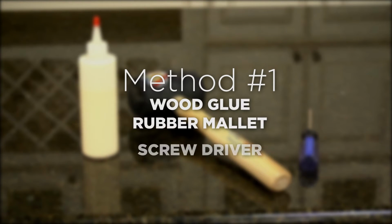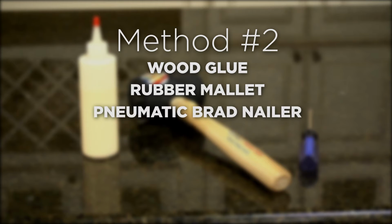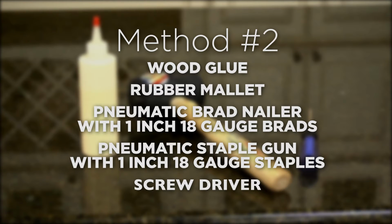First construction method requires wood glue, rubber mallet, and a screwdriver. Second construction method requires wood glue, rubber mallet, pneumatic brad nailer with 1-inch 18-gauge brads, pneumatic staple gun with 1-inch 18-gauge staples, and a screwdriver.